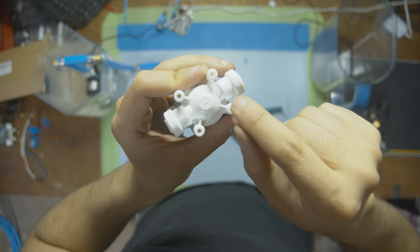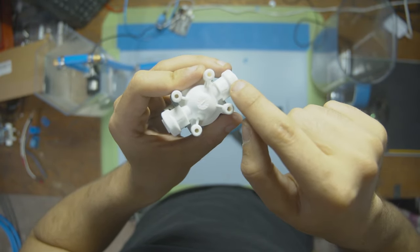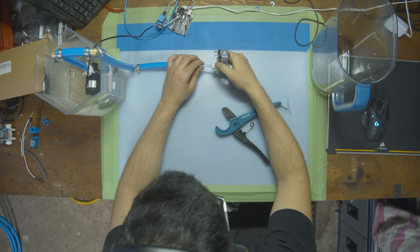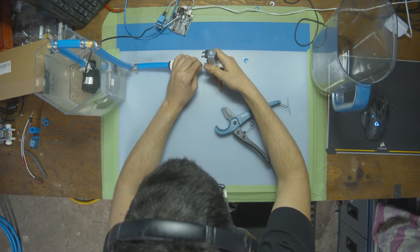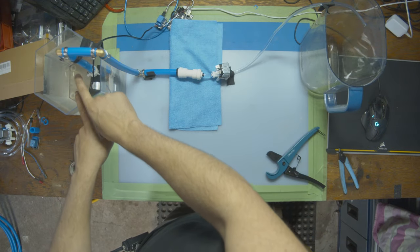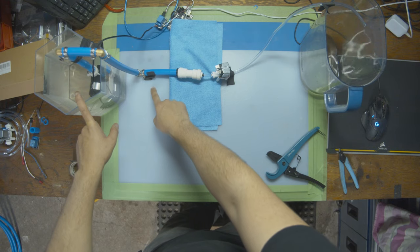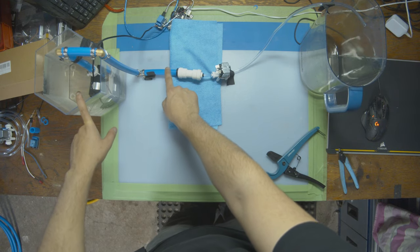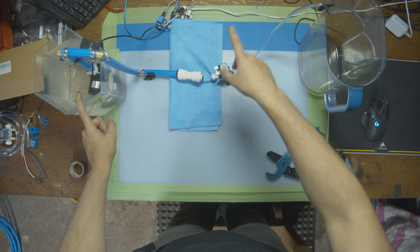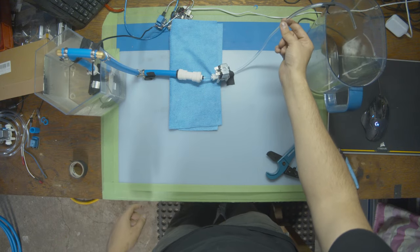See right here and right here, there's arrows pointing the direction of where the water flow should go. So it should be going like that. So we're gonna take our water solenoid, we're gonna plug it into the quick connect as tight as we can. So we have pump, tubing, down to the table. At the table, we go elbow into PEX, PEX into tubing, tubing into solenoid, and solenoid into the next bucket with the super skinny tube.